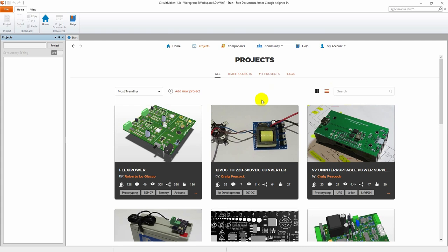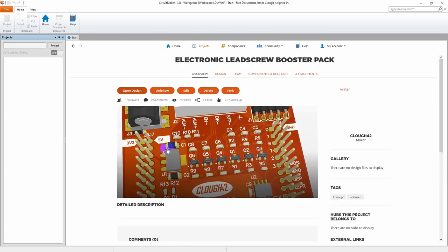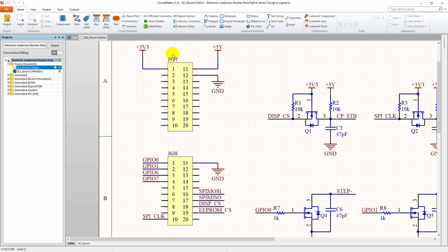So let's jump in here. I've got my projects open and the electronic lead screw schematic here. This is the schematic for the PC board. Over here on the left are the connectors for the booster pack — these are the headers that attach the board down to the microcontroller prototyping board. There are two of them, 20 pins each, and this is where all the signals of the microcontroller are coming from. We've got power and ground and all of the GPIO and SPI lines that we're using, and instead of drawing this all out I've just labeled these with net names.